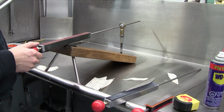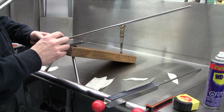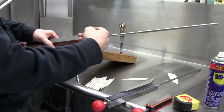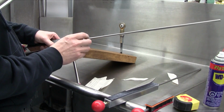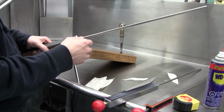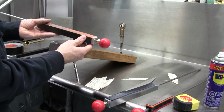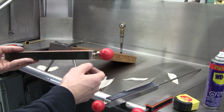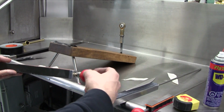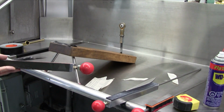And what else? I also forgot to mention that these rods here, there was a hole drilled, and I got a machinist to drill the holes about 2 inches deep, because I wanted the hole to be drilled in the aluminum square bar perfectly straight. So I just put the 5/16 rod in there with a bit of epoxy glue. Same thing at the end here, the machinist drilled a hole, and I just put a bolt again with epoxy glue, and then I bought these plastic knobs here. I believe I bought them on eBay, and they just screw on the threaded bolt here, and I put a lock nut to make sure I don't lose the knob.